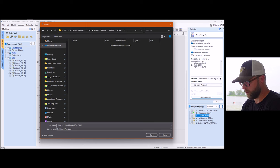Index holes, we would turn this off. It's gonna give me an error, and we're gonna say okay, and we're gonna save the toolpath. This one is just straight up. Because we turn off, hold on, wait a minute. Memory's coming back, I just did it yesterday. Hold on. Save, because I turned off tiling. It should come up without it. There it is. So I actually went in and manually renamed this one T1 underscore because I wanted it to stay consistent with my naming convention. That was me being a little tweaky. Same thing for this guy.